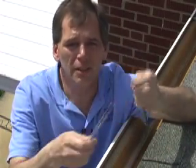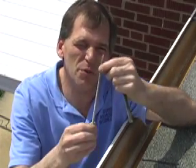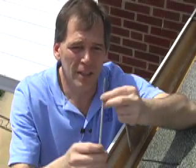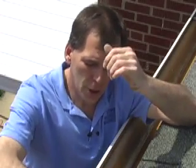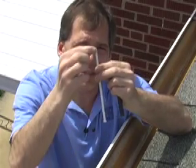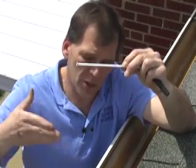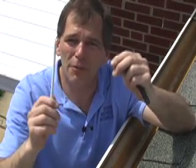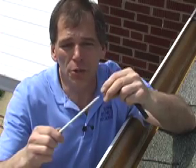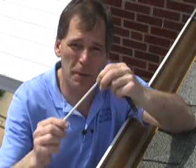Your typical aluminum gutter anchor consists of an aluminum sleeve and a straight gutter spike. It does have some small grooves in it but for the most part it's smooth. What I'm suggesting you do is go to the hardware store and buy this — it has a plastic sleeve and it's a screw-in gutter spike. These threads are oversized so as to grip into the wood where the gutter spike had already punctured the hole. Pulling a screw out of wood versus pulling a nail out of wood, you've got a lot more gripping power with screw threads.